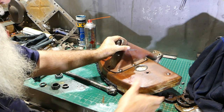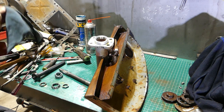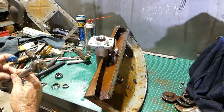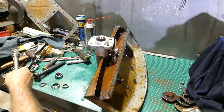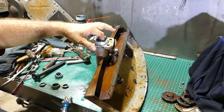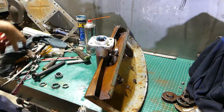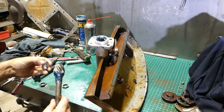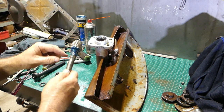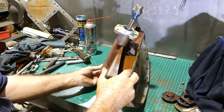From this bottom end it goes in from this end. There's a bit of noise — airplane going over — but we can see what we're doing. I put a bit of grease on there; I just like grease even though this bottom bearing's in oil. The bearing cup sits down in here and then this other cone goes in. Normal tapered roller bearings are two-piece — these are three-piece.